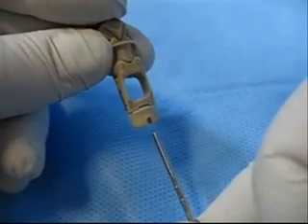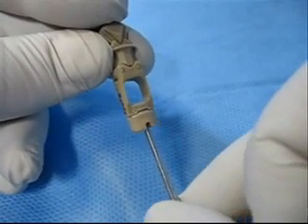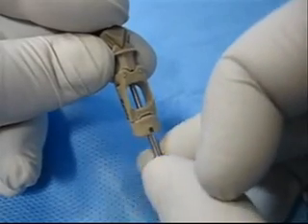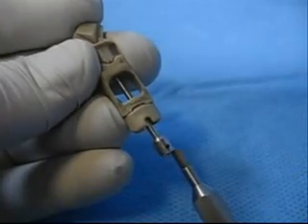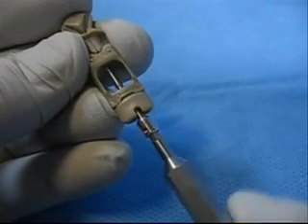With the thumb and middle finger, apply pressure to the left and right arms while applying pressure to the wedge with the forefinger. Insert the screw into the body and begin screwing by hand. Take the hex side of the removal tool and insert the screw the rest of the way while still applying pressure to the arms and the wedge so the wedge does not pop off.